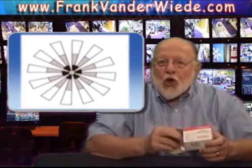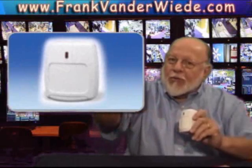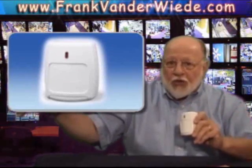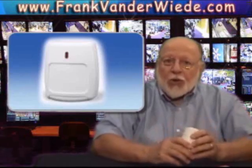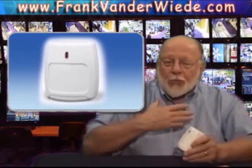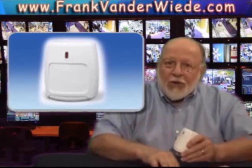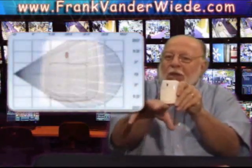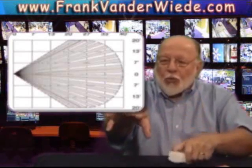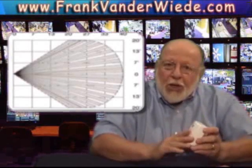By far the most popular is the corner mount detector, because it can reach out 35 to 40 feet and cover a large area. So a small detector nestled up in a corner can really divide a house almost in half. It does this with infrared technology — it's looking for your body temperature versus the ambient air temperature. When it sees that temperature, it'll look for movement. It can detect movement because it broadcasts beams, fingers of protection, out into the room. When the temperature mass breaks two of the beams, it will determine that there's a person moving in its space and that will activate the alarm. Putting it where a person will cross the beams is much more effective than putting it where somebody can walk up in between the beams.